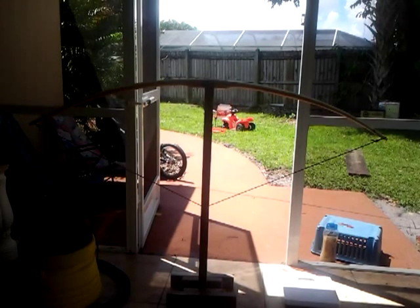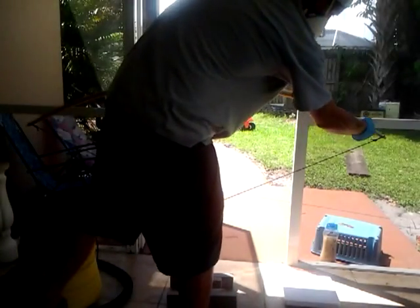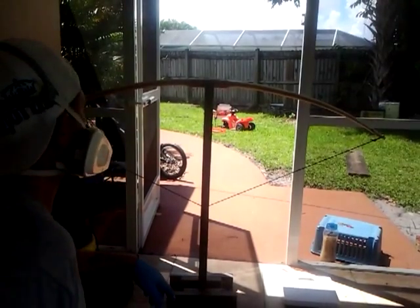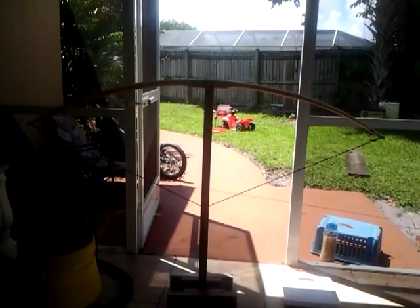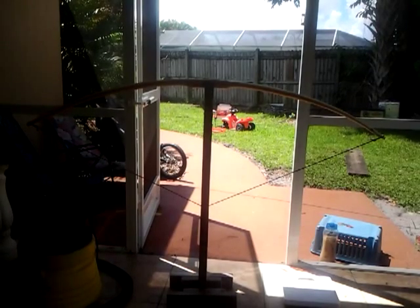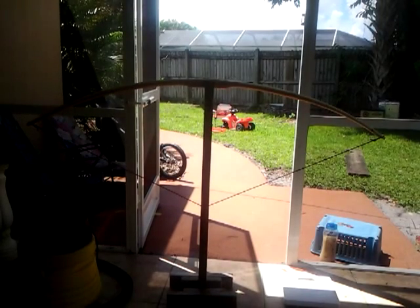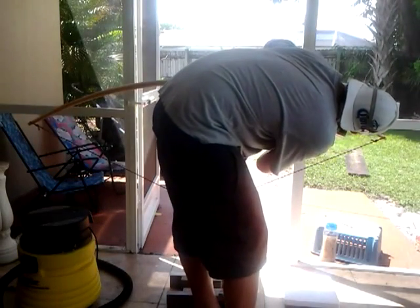So I can actually start checking out the tiller itself. And what you're looking for in tiller is any flat spots or hinges in this curve. So what I do is I'll step back a few feet, about where the camera is, and I'll take a pencil and look. It's really just eyeballing. And that's actually looking pretty good. Let me see, I could probably take a little bit off from here to here.